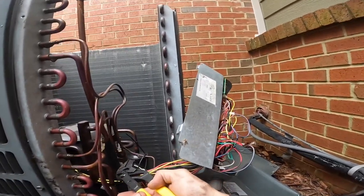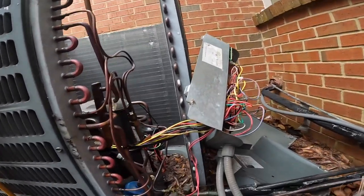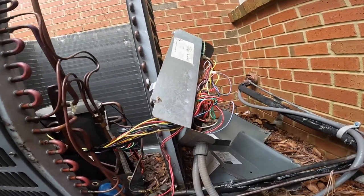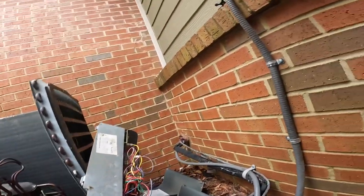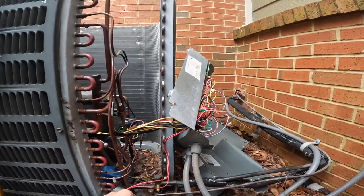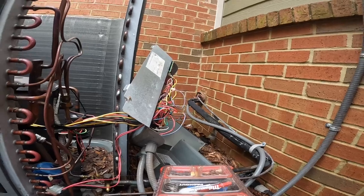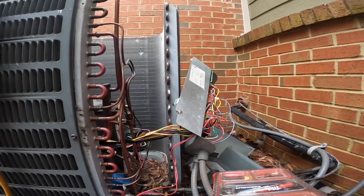Now that piston is what I'm most concerned about. If there's something in it, I want to see it. But first I'm going to get this dryer out of here. I think I'm going to cut this piece right here. And then we're going to swage us a piece of 3/8 to go in place of all that.